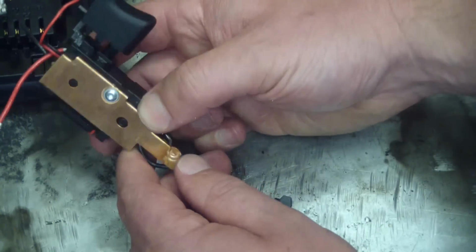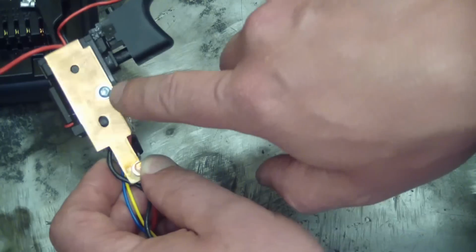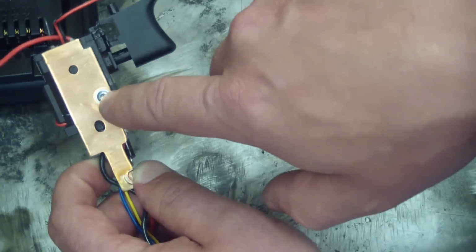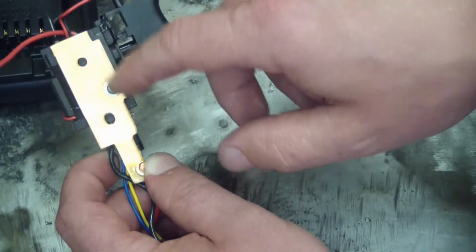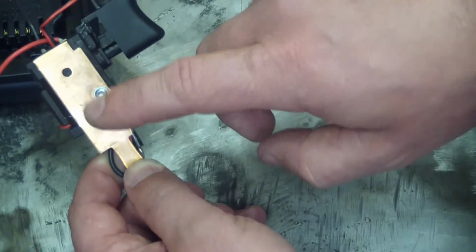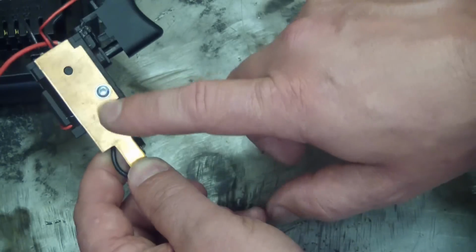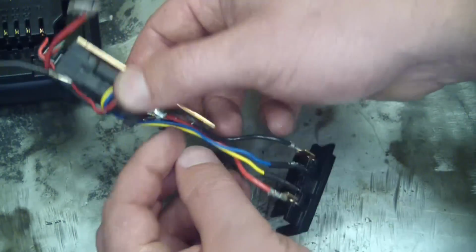Now what we see on the backside is a lovely copper heatsink. And this will be attached to a MOSFET. That'll be the switch that this brain box is using. It's essentially a relay, and that thing gets hot. I like to see copper because it's got twice the thermal conductivity that aluminium has. It's probably 4 times the price too, but that's nice to see.